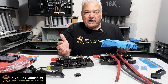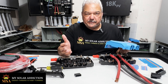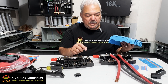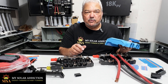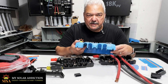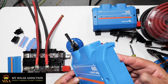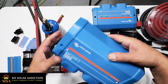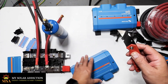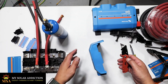If I would have started out thinking I was going to do this whole switching between sharing battery banks and individual battery banks — three different configurations which I'm accommodating by doing this — I would have started off with a bigger wiring trough underneath my Power Pro batteries. I went with the 8x8; if I had gone with the 10x10, I wouldn't be having this issue. I'm going to show you in another short video how I'm going to cut the side out using a hot knife to solve my problem with the cable coming out the side. I'll also need to do the same thing on the other side to reach the Lynx distributors underneath the two 18K PVs.